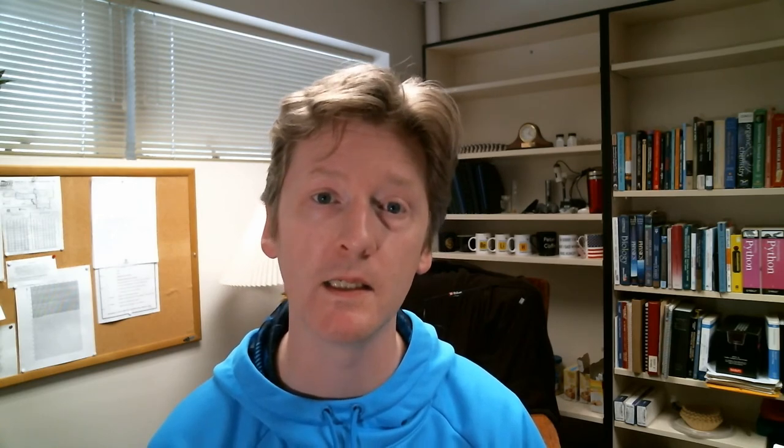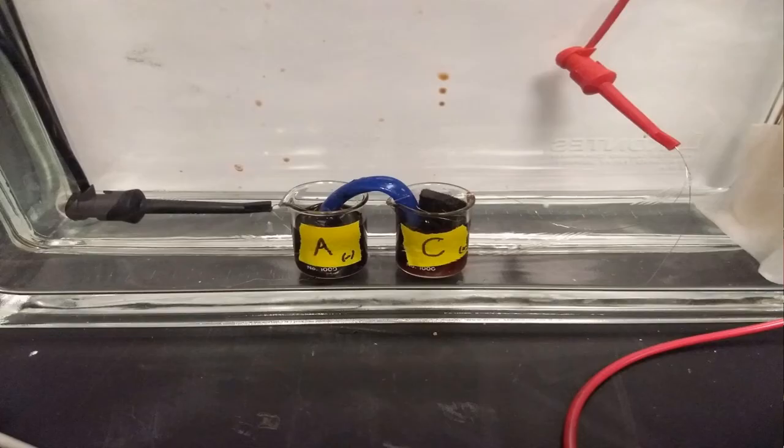The iron sulfate, on the other hand, has been running now for more than six days, and it has not lost any apparent activity. It's still discharging at 400 microamps for this type of battery — that's not bad. We've logged 200 coulombs or more, and I'm still seeing no loss of activity. So in principle, it could discharge as many as a thousand coulombs, just based on how much iron salt is present. But until we see the end of it, I'm going to keep discharging it and just see how far it goes.